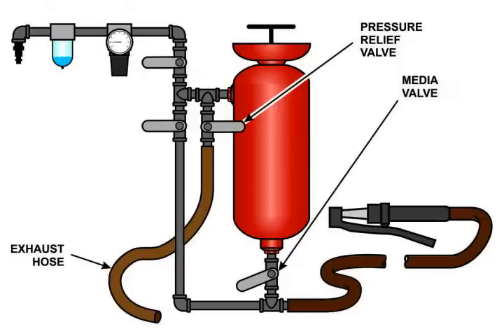Adding a T in-line either where the air enters the pot or in the supply line after the regulator and supply valve will allow you to insert a ball valve and hose to depressurize your pot with. The valve should be mounted with the handle easily accessible and the discharge hose should be secured near the bottom of the pot and aimed in a safe direction. If you are using a cabinet, the simplest way to do this is to use a length of garden hose exhausting it directly back into the cabinet. When using a valve, always open it slowly and remember to close it as soon as your pot has depressurized.